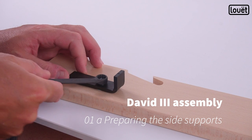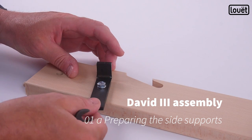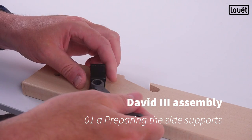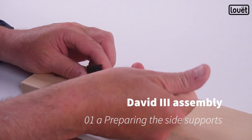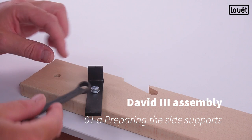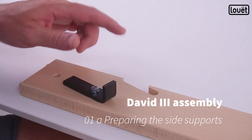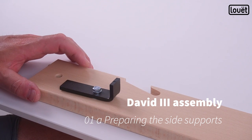Okay. So that's why we unscrew it slightly. Now it's moving freely. If you unscrew too much, you get a lot of this play. So we're going to tighten it back up a little bit, reduce that play. Well, now that's too much. So you can see this very small adjustment, about an eighth of a turn, maybe even less, made the difference from being wiggly. Now it doesn't have that play and turns freely. And that's really what you want. Okay, we'll go to the next step.